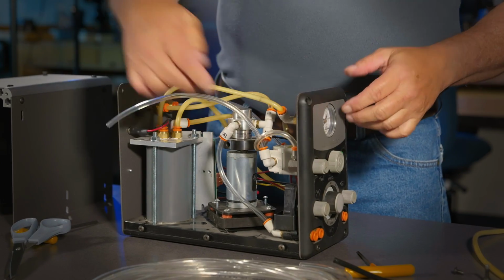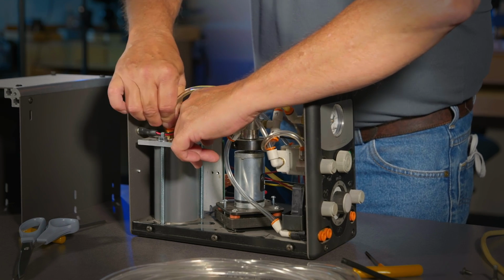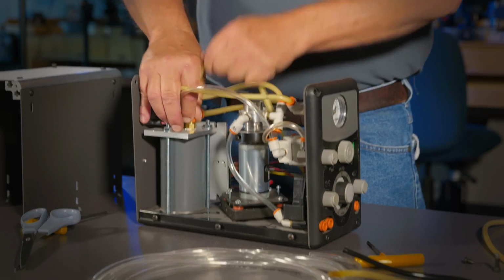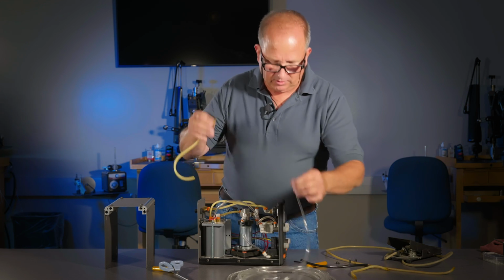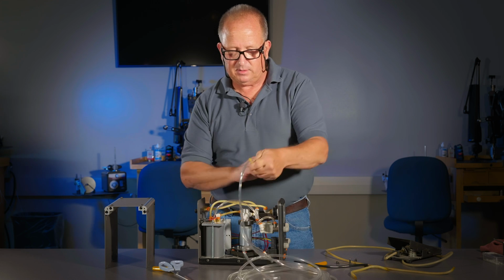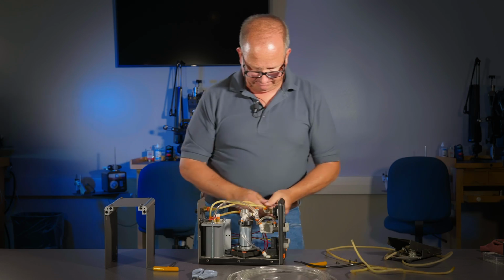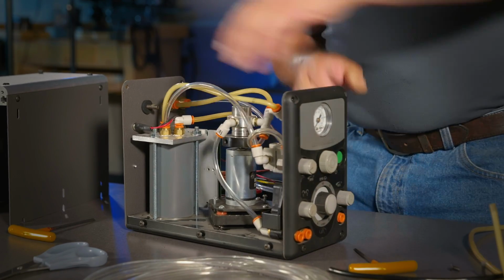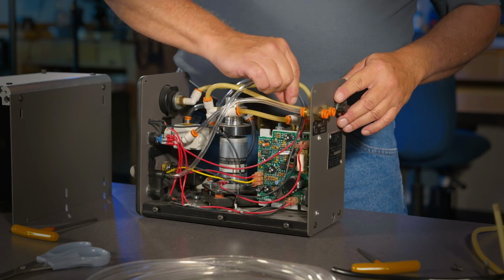See, I left the fitting in the same orientation. It goes up over, and you can see around behind the wires of the electrical input. Then coming out of the air tank into your auxiliary valve, the bottom of the auxiliary valve, this one's missing, generally has a wire clamp. I don't know the part number off the top of my head, but call me and I can get you that. But this slips over the auxiliary valve, just like that, comes over these hoses and back into your air tank.